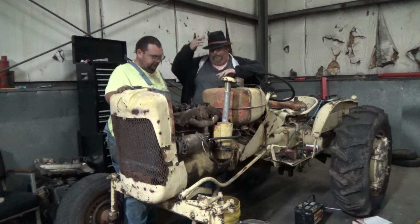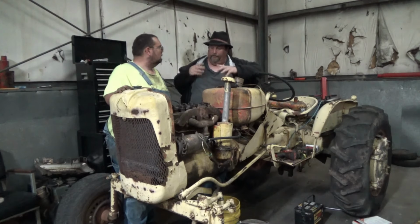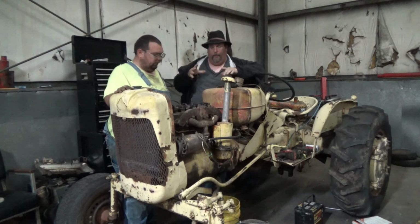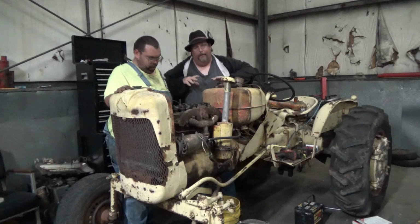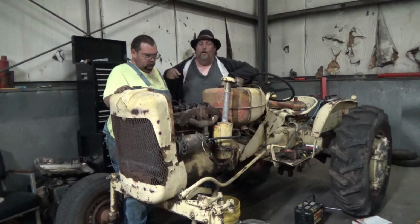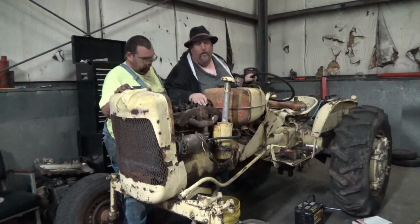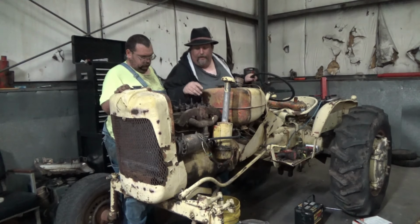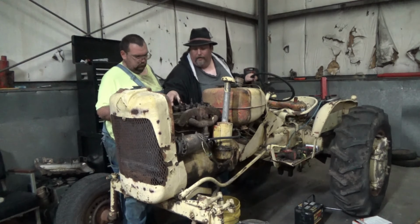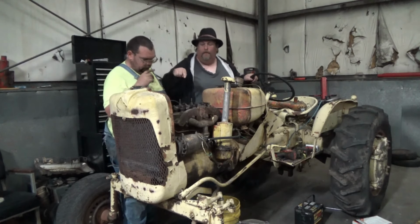Okay guys, so Doc's been working on this for quite a while. I actually haven't filmed for a while because of how much he's been doing. We got the distributor right. We were off a little bit. The carb's cleaned up and fixed and working correctly. We're getting fuel. But when we were cranking, we noticed something. All the cranking we've done, we've not pulled any oil up to the valves. And then he noticed that the intake valve on number two is not moving at all. So we may have a deeper issue in here.